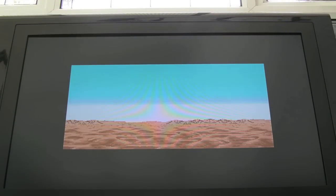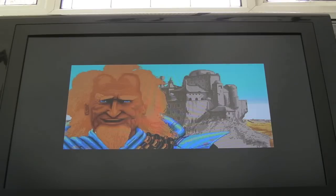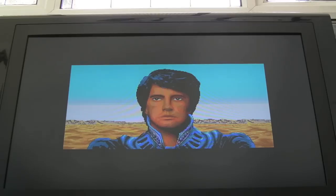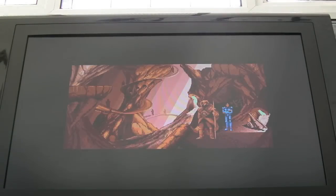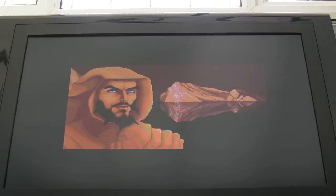Other things I did that I didn't show, I did off camera, I measured the voltages on the caps. So all of the electrolytics on the board measured across the positive and the negative. So, for example, the ones on the right hand side had minus 12 across one cap, plus 12 across another, plus 5 across the cap somewhere else, 2.3-ish, 2.35-ish volts across one of the ones in the middle of the board that provides the audio bias. And then the audio coupling caps at the back, again, 2.3-ish volts were across those. So I know all the caps are okay. Caps have been replaced by the previous person that's worked on this extensively.